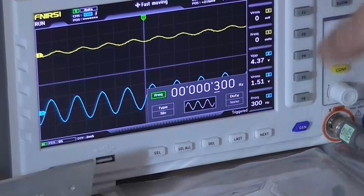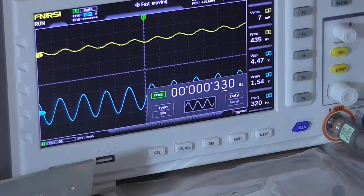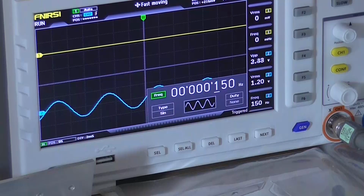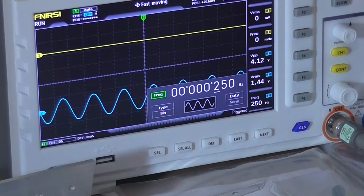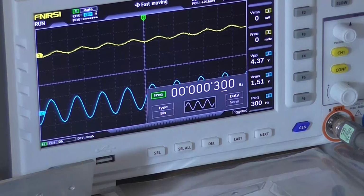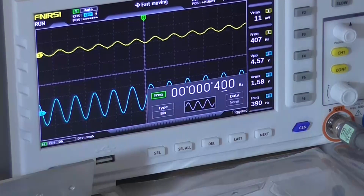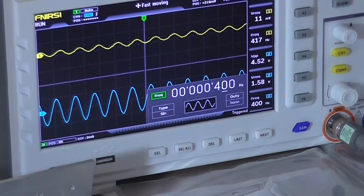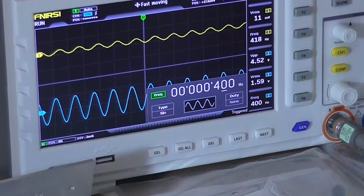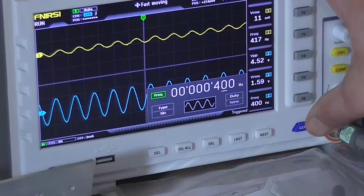So okay, that's fine. So we know that around about the 300 mark is where the voltage starts to come back up. So 250, 90, yeah, I'm going to say 300. At 400 Hertz we are bang on the money. So it's going to start rolling off around about 350 Hertz with these current capacitor values. A larger output capacitor probably will give you a little bit more bass.